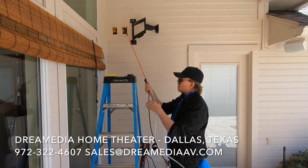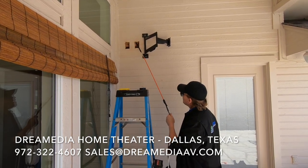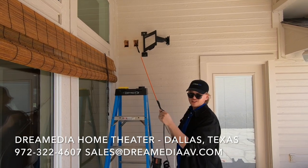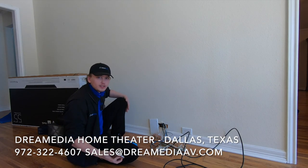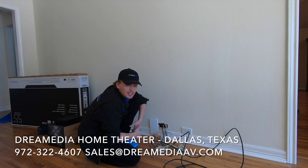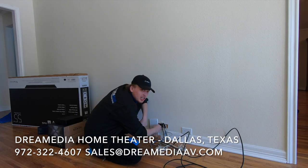So now what we're doing — we got our gang boxes cut and we drilled a hole through the beam into the attic. We're going to fish up our HDMI and our Romex for power. We'll see you on the other side. All right, we're back on the other side. We got fisherman Zachary in the attic, and I think he's got it — we got a big one up.